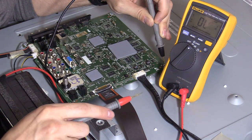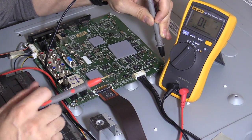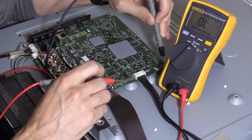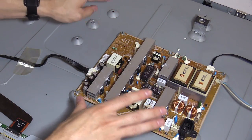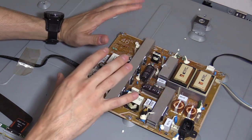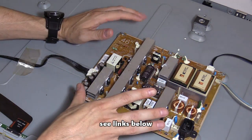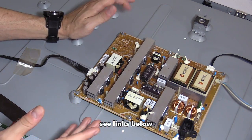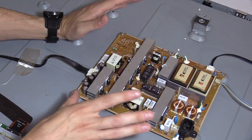It's probably a power supply issue. What causes voltage to jump around like that is usually bad capacitors or a voltage regulator — those are things that regulate the voltage and keep it steady. If you're a novice tech and just want to fix your TV and get it up and running without buying meters and tools, you could just buy the power supply board at shopjimmy.com or electropartsonline.com. That board would probably cost maybe 30 to 40 bucks and comes with a warranty. That's the easiest, fastest way to fix your TV.